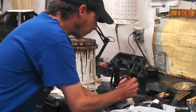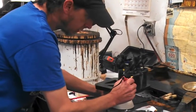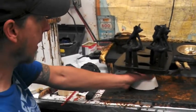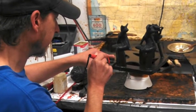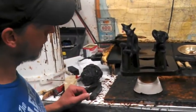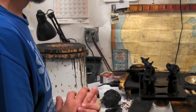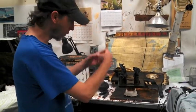I'll just go through and weld one half of each gate. Once those welds are cool and bonded, I'll go back and weld the other half of each gate. Once it's full, we'll take a torch and smooth everything out so that the metal has a very smooth path of entry — basically just to reduce the amount of turbulence as the metal rolls in.